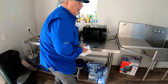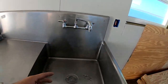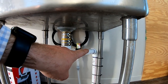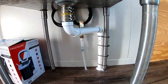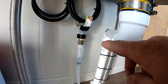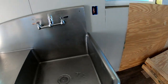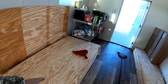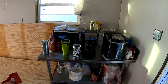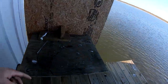There's Papa Donnie. This is the sink that we plumbed yesterday — just a stainless steel sink from like a kitchen drain, connected with a no-hub. It goes to the back wall, down into the water. Over at the barrels there is a splitter with a couple of valves on it. It transitions to Uponor PEX and that goes through the floor, so both hot and cold will work if we want to. There's gonna be three sets of bunk beds — not built yet, but we've got the mattresses and all that. This is kind of a little wet bar kitchen area — overflow storage, coffee pot and all that.